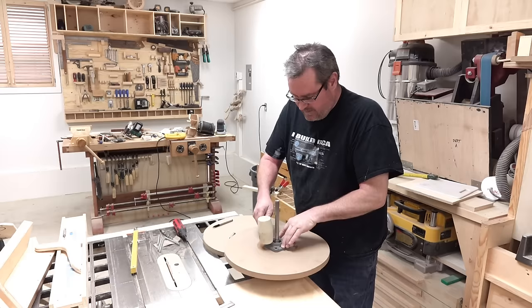After I get this all put together and adjusted with the blade on it, tension, the whole works, I'll drive a couple of screws, maybe 4 screws, through this plywood into the lumber to lock that in position. It won't move, so it won't be just relying on the bolts. Well, I've got the wheel put back in, tied up against the frame members. I can get a measurement for how long the 2 cross pieces that go in here need to be.